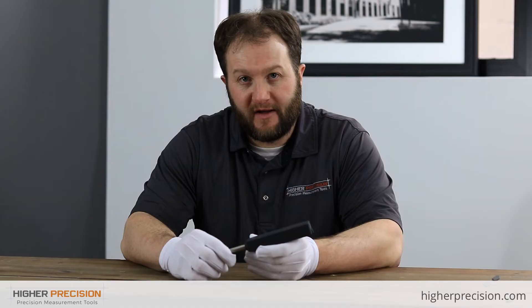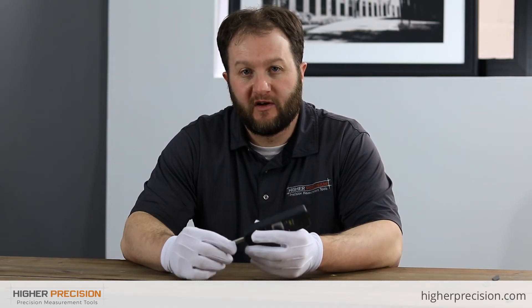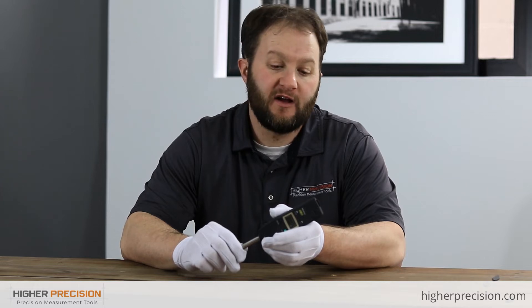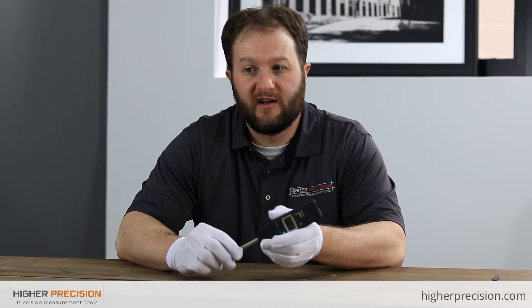It does include a flat back. There is no lug that comes on the slim and simple design, so anytime you mount this gauge it has to be mounted by the shank directly underneath the large LCD display. It does have SPC output, so for those of you serious about data collection, you can easily hook a cable up to the indicator — the other end connects to your PC — and with just the push of a button be sending data very easily.